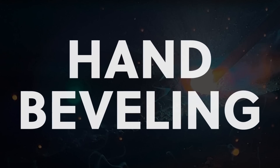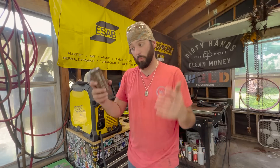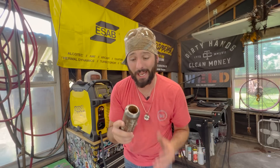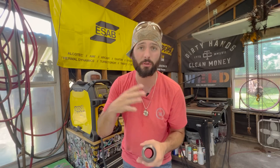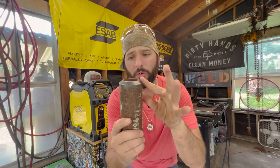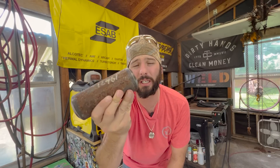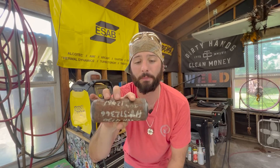So let's talk about beveling heavy wall pipe. Devin wants to know how to hand bevel this pipe better, but I'll tell you what — I'm going to avoid grinding a bevel on this by hand like the plague. I want to use some form of cutting process, a beveling torch, whatever I can. Use some form of automation — maybe it's a factory end — but that's what we're going off. I'd like to use even a roller, some sort of automatic rotator, or a hand wheel; it puts a bevel on really easily.